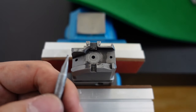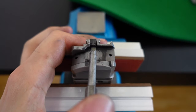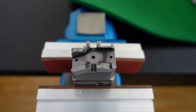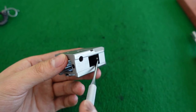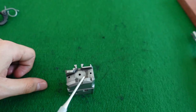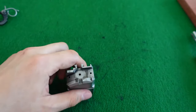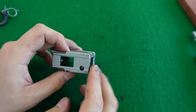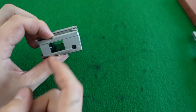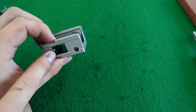To remove this I'm going to use a special rounded bit to avoid scratching things up, wedge it underneath the cartridge holder, give it a firm push and just pull it right out of its recess on the bolt head. On the bolt head you have these two dome-head pins. Technically you should be able to remove these by punching them out via the disassembly holes, but I'm not going to do this for two reasons: I do not have the special convex-head tool to put them back in, and the distance between the tip of the dome head and the surface of the bolt head is under tolerance — I don't want to disturb that fit.